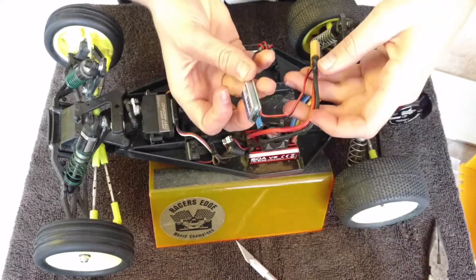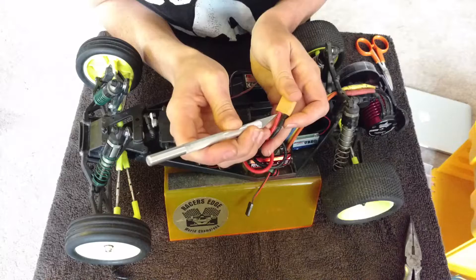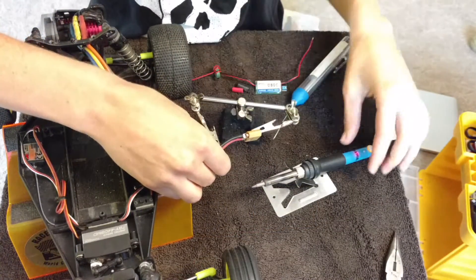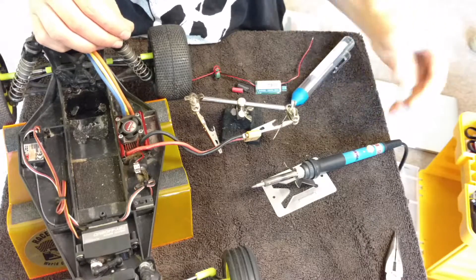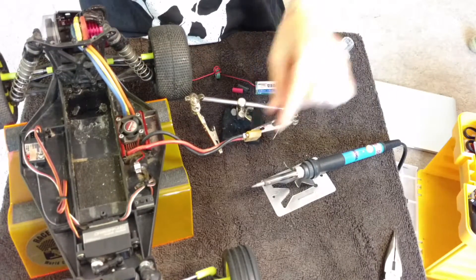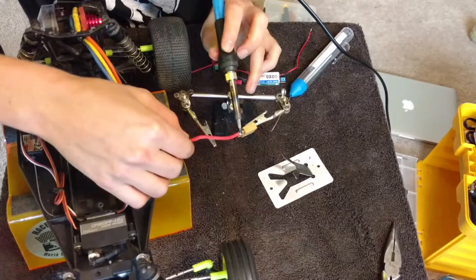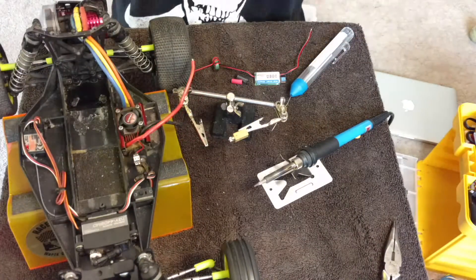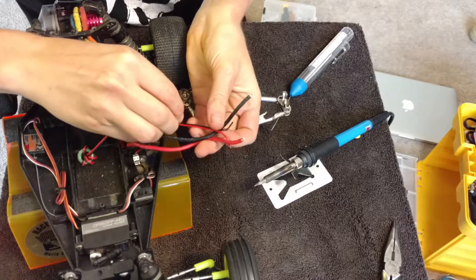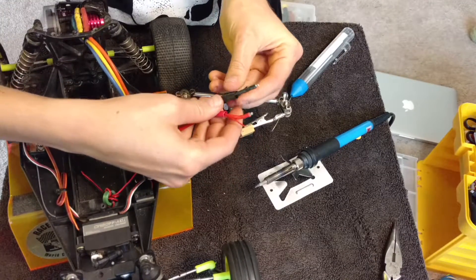You're going to want to solder these into your battery connector. Your first step is removing the heat shrink — get an X-Acto blade and make a really shallow cut just to get this off. You want to remove your cables, and be careful with the soldering iron because it gets really hot. Just touch it to the cable, and once you see it heat up, pull the wire away. You don't want to melt your connector. Put your heat shrink over the wires and get the heat shrink out of the way because you don't want it to shrink at the beginning.